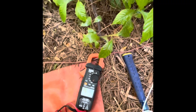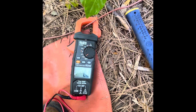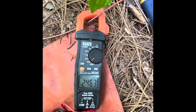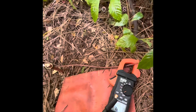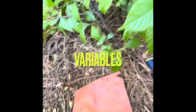The neutral to the ground rod — 246. I got you 246 right here. I can't tell if my hands itch because of the gloves or if there's current going through me. Now, there's some variables here, and this is why I'm doing this — because shit ain't perfect in the real world. I should probably get that neutral off the ground.